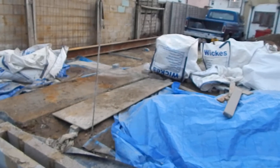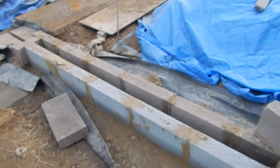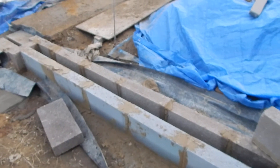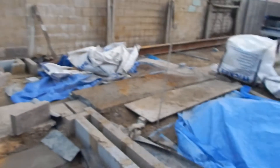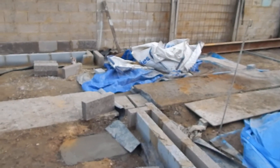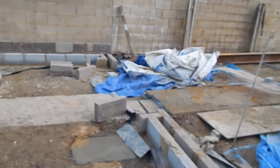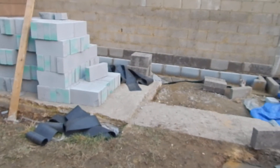Tomorrow I should have some more blocks delivered and then I'm going to crack on. I'm going to do this bit down here — two courses, an in-and-out course, and then the inner course all the way around. And then Sunday I'll be doing the third course, and then that will be where the wall ties are going and the first lot of insulation, then wall ties, and then probably set up corners for the next row.